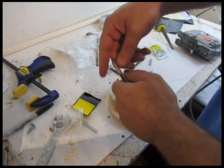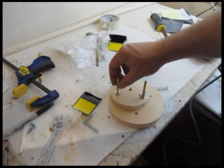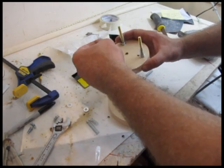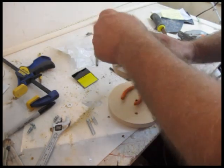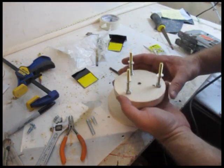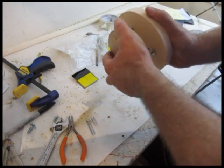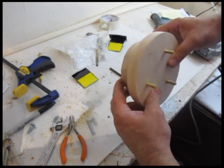Now we're putting some springs on these. I bought a little packet of springs at the hardware store, cutting them down to about one inch, and putting them right over each one of those bolts. A spring on each bolt. Then you can assemble this right onto the large disc. I did put washers on top of those springs too — everything gets washers, both sides of the spring. See, we have a nice setup so we can adjust the mirror.